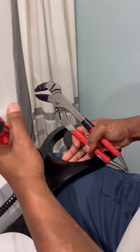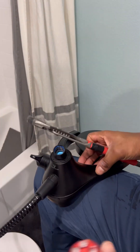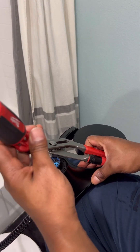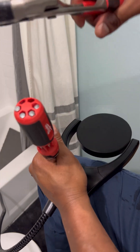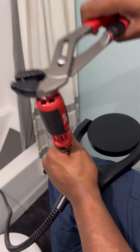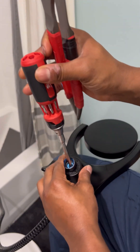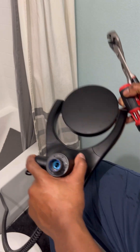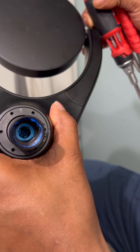What you're going to do is grab your screwdriver and stick it right on the back of the flow restrictor — just like that. Then grab your hammer or some pliers and just bang the back of it. You're going to create a hole straight through the flow restrictor, just like that. See how the hole is created.